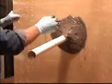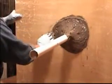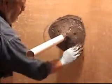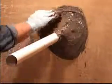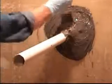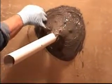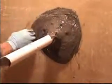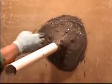As you see, what I did was made sure that we had at least 2 inches around the fitting itself, and that's how we finish it off. Keep in mind, it doesn't have to be necessarily pretty. You try to make it as neat as you can, but keep in mind you need at least a 1/2 inch thick here, consistently throughout. I tapered it off just a little bit around the edges so as not to make a big mess. But that's fine right there.